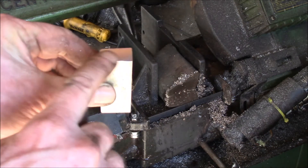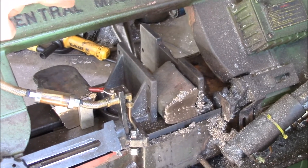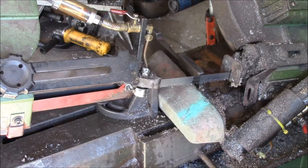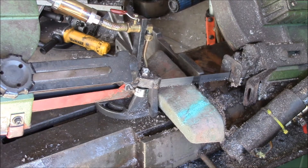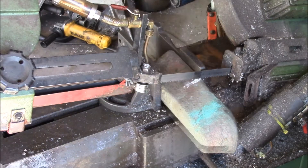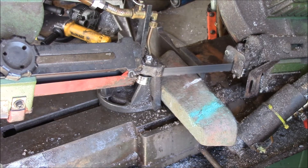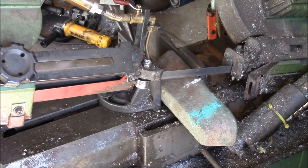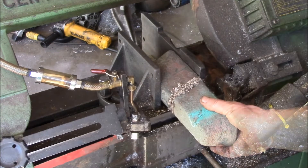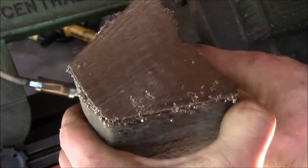I cut a little piece of aluminum and machined it down until it was just the height of the ingot, so I can back up the far side of the jaw — because those parts are very irregular. I just slide it in and find my halfway mark. The second ingot is a slightly different size so my center mark was a little off, but let's give this one a try. I'll release the down feed. Yeah, there's another 10 pounds — you can see the ripples from the casting.